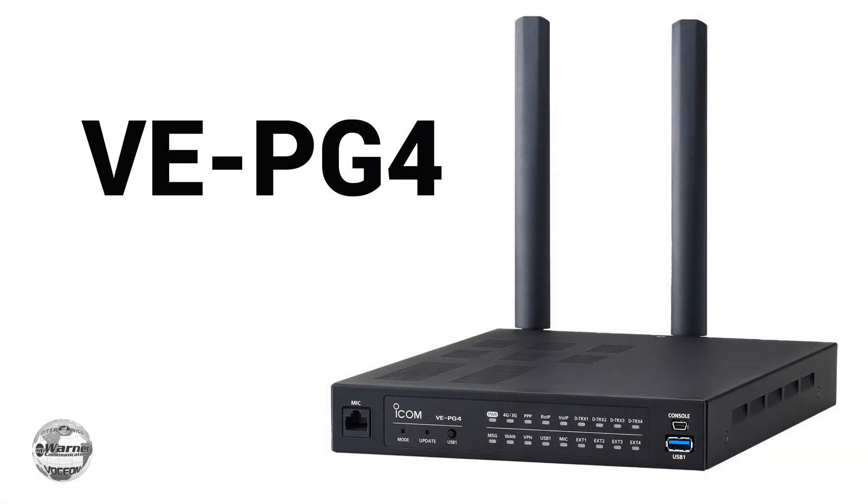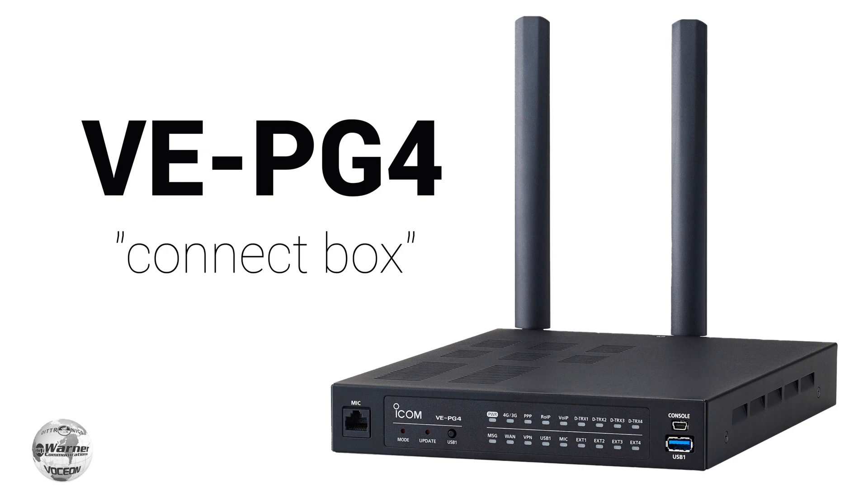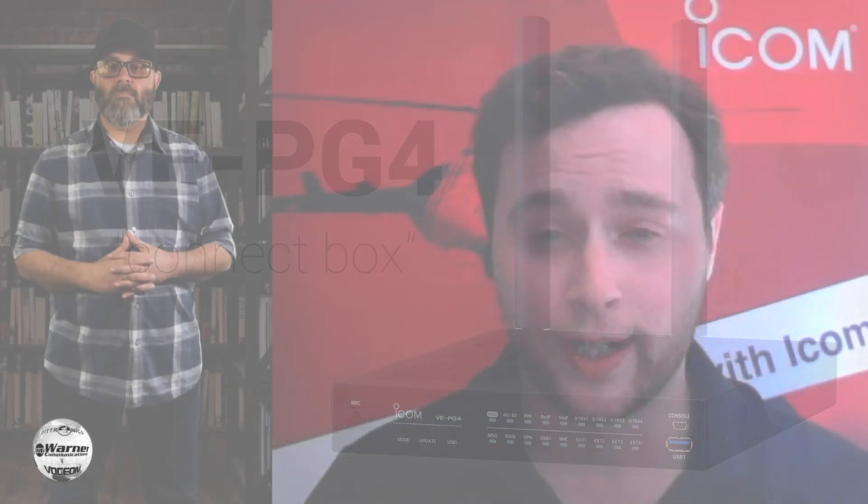What we would do is use our VEPG4 — we'll call it the connect box. With that connect box you have an IP1000C WiFi radio controller and you can connect up to 50 WiFi radios into that device. Those wireless LAN WiFi radios connect to the VEPG4, which allows them to talk to your localized VHF or UHF handsets, creating one big mesh communications network in your localized area.